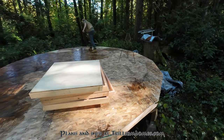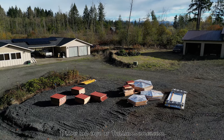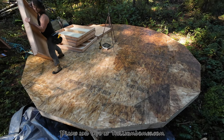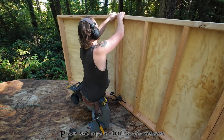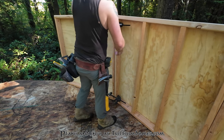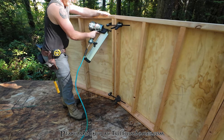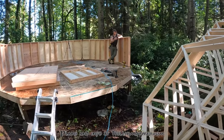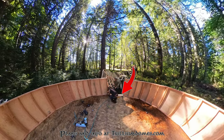The process for laying out the base sections of the pony walls is going to be the same whether you're building on a deck, a gravel pad, or a foundation. The base of the dome is not necessarily going to match up perfectly with the deck and it's designed that way to make deck building easier. If there is a discrepancy, it's always the dome that's going to overhang the deck frame by an eighth or a quarter inch maximum. Therefore, we want to lay out the base sections or pony walls independently of the deck or gravel pad by laying out all the base sections and tacking them to each other first, but not attaching them to the ground yet.